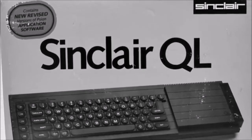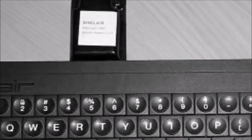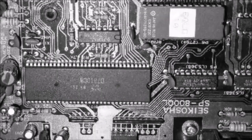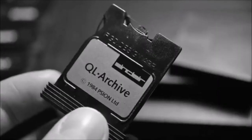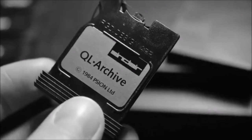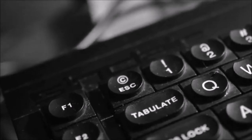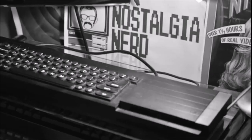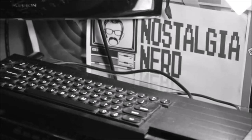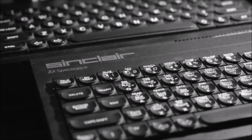However, due to this apparent rushing, the first machines were plagued with problems. Some had half the ROM plugged into a dongle on the back, others had firmware bugs in a built-in SuperBASIC language, and most suffered from unreliable microdrives, which were chosen due to their lower cost over floppy disks but higher speed than tapes. These problems tainted the initial reputation of the machine, but in reality it just wasn't well suited for the business world. The microdrives were non-standard, the keyboard was uncomfortable, and most people associated its look with the soon-to-be-released Spectrum Plus model, and therefore cast its professional credibility aside.